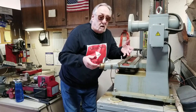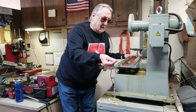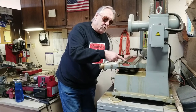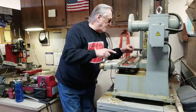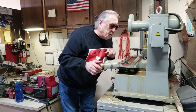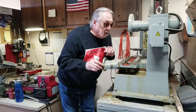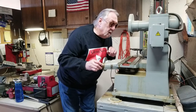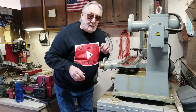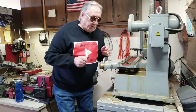I may end up getting rid of the rack and pinion gear altogether and go with a cable system — a cable hooked on each end of the table that goes in, around maybe a couple of times, and then over here. I know I've seen that on other grinders; I don't know where you'd buy something like that. I'll get some pins, clean that off, get some measurements — depth mic and some pins. That's what I'll get.